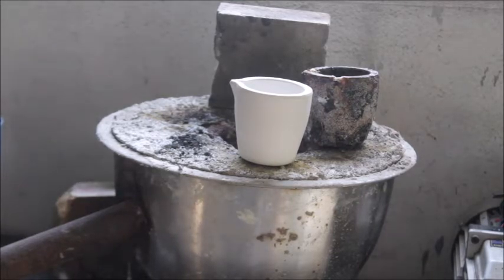I'm going to do a whole separate video on how to make that coating — it's dead simple. You make it with water glass — sodium silicate — and you crush up some ceramic floor tiles. I coat my crucibles with it, and I also line the inside walls of my furnace with that coating.